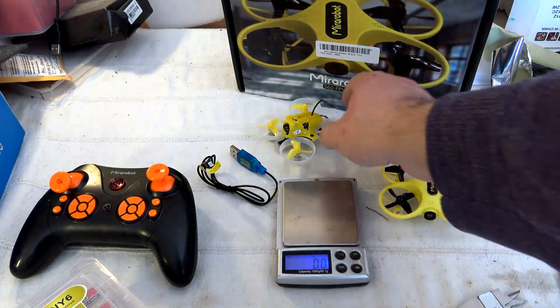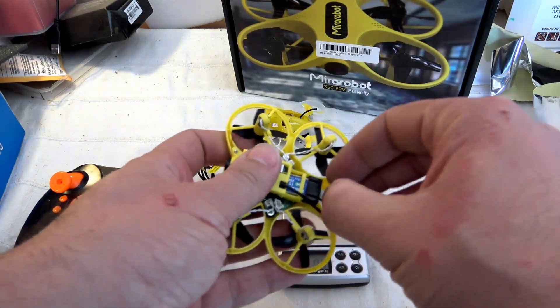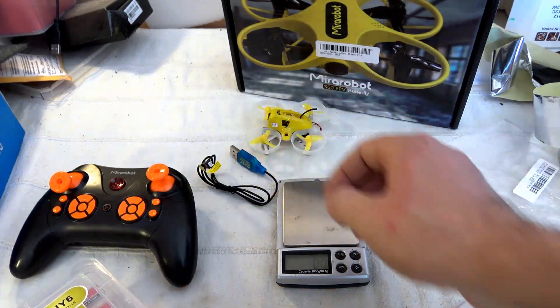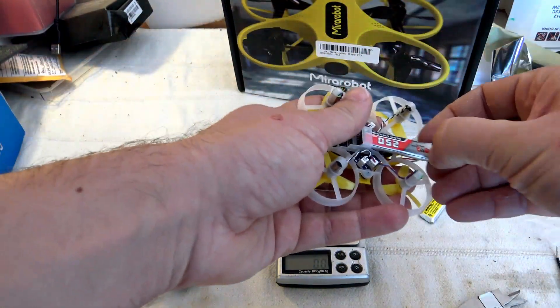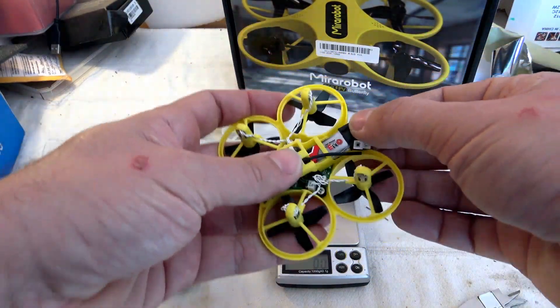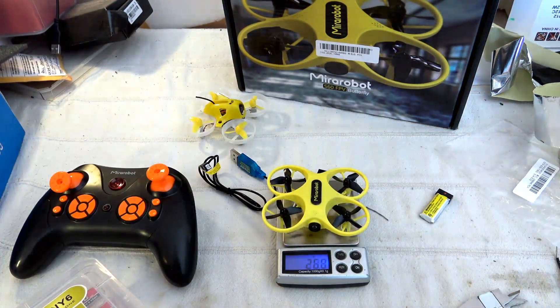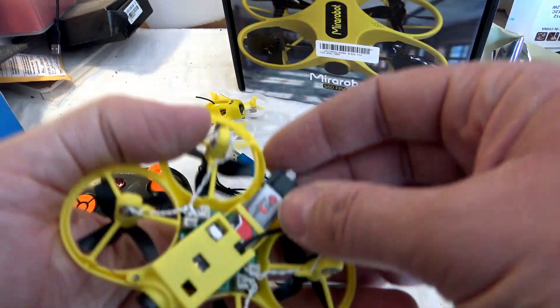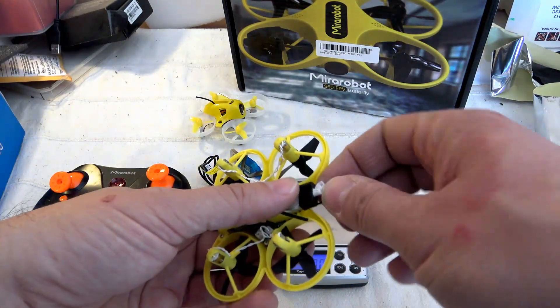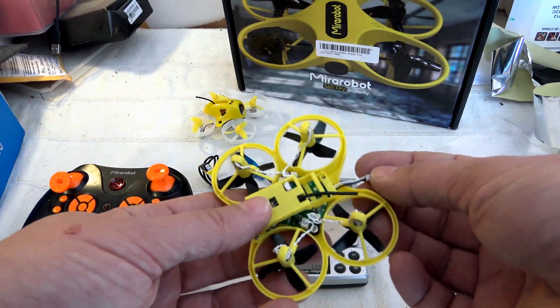The question is: can we install the Tiny6 battery on the ZS16? The answer is not super clear because there are some gaps and free room in the battery bay. The weight with the Tiny6 250 mAh battery is 26.5 grams — the same half-gram difference remaining. However, we can't really connect the battery easily because the lead wires are too short, so you would need to extend them.